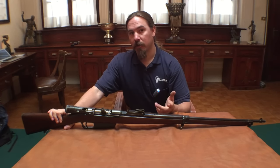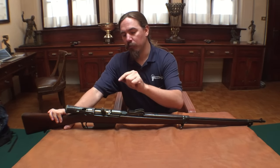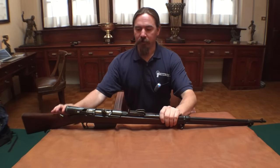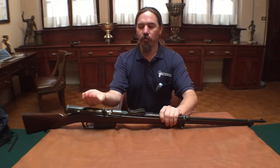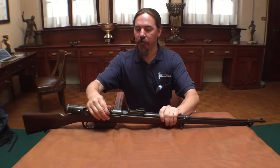Now that cam can't move it very far. The original Carcano was a 2-lug bolt where you had to rotate the bolt a full 90 degrees to unlock it. They've replaced that with what appears to be an 8-lug bolt, where it now only requires a very short throw to unlock — enough that this cam can do that.